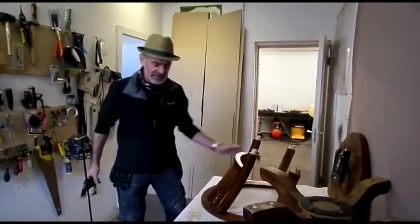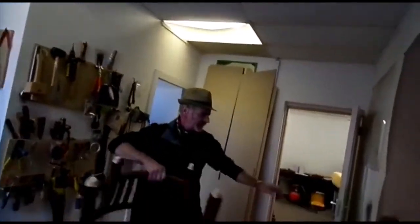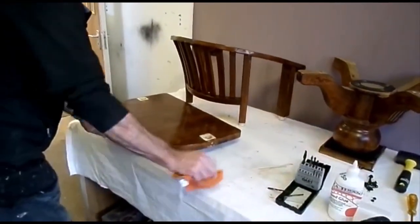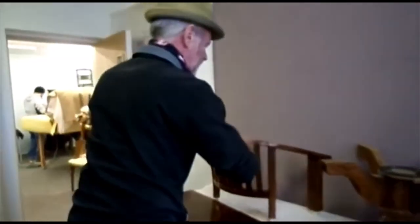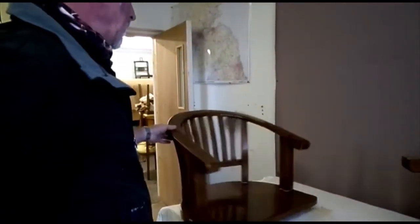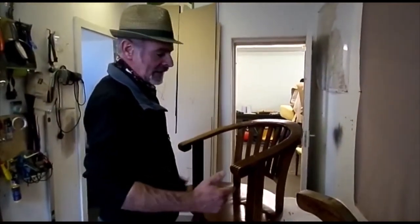Next step is to get these clamps off and see how it'll fit back to the base itself. Originally it was pretty much just nailed together with a nail gun, nothing else — no adhesive, or maybe a little, not a great deal. So we'll dry fit it first and see how it fits back together. That's pretty much the dry fit, which tells us it will go back together. So we're going to glue all these and wrestle it back in, then clamp it for the next phase.